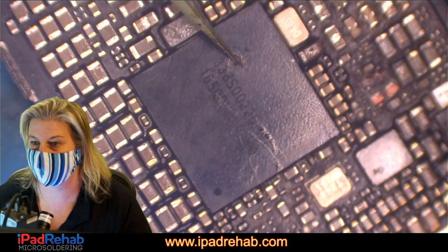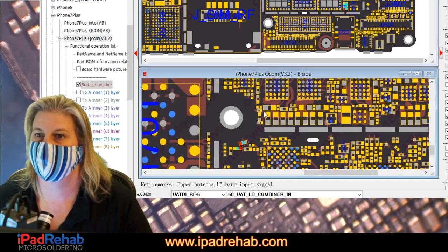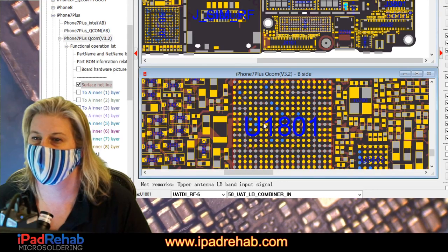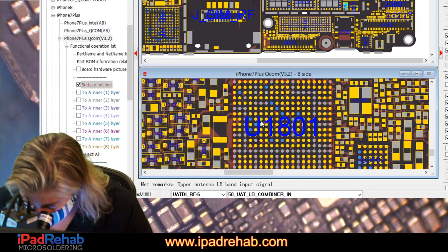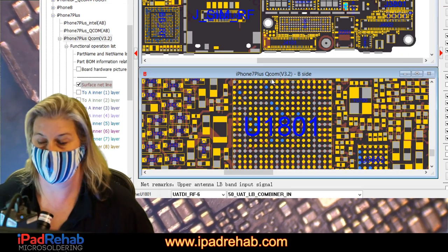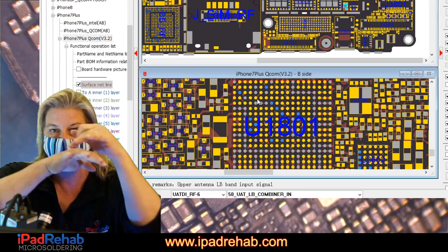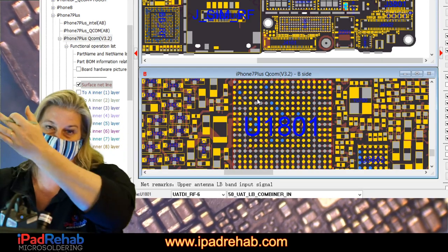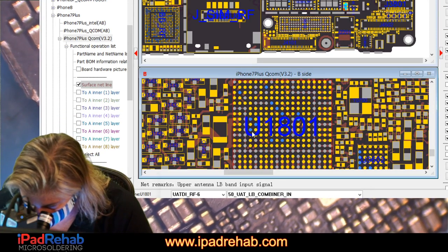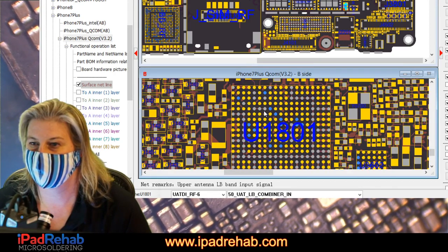All right, let's go back to ZXW. And we're going to keep applying the same strategy to see if we can figure out what in here. Let's see. It's above this. When we do this sort of map a ball technique, the problem with it is it's not necessarily the ball, but it's the circuitry within the chip, which may go from here to over there. So that's what makes this map a ball method a bit of a blunt tool.